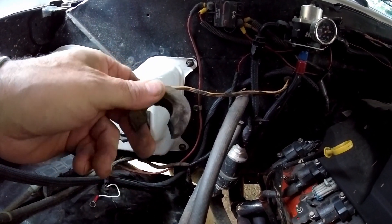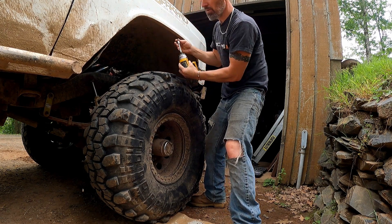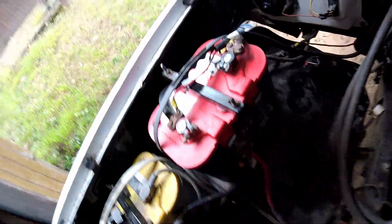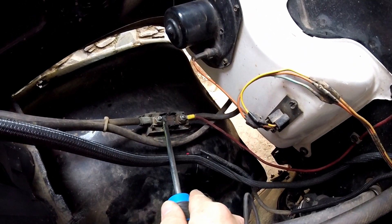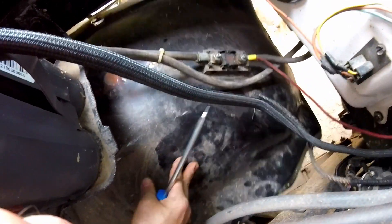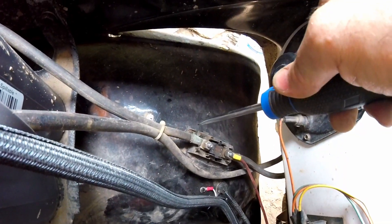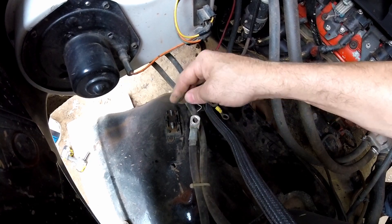So I took out the rubber piece I had wedged in there - it worked awesome, I'm not gonna lie. I was real tempted to just leave it, but nah, I gotta fix it. There was zero noise, so it did the trick. I got it all except for the wires from the inverter because they're hooked to a fuse. I'll take these terminals off and this whole thing will drop right down - as you can see, only the very front bolts are still holding it. I'll take those out and we should be good. That one there is the only one with power to it, so that should be fine sitting there with no arcing.